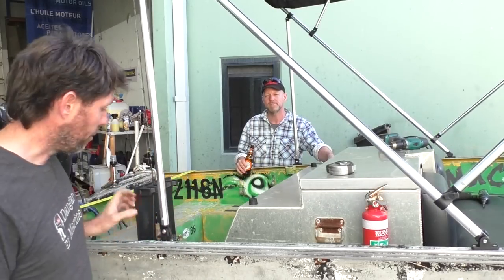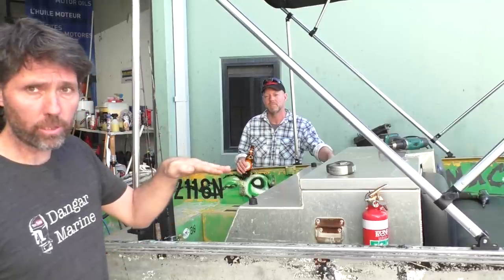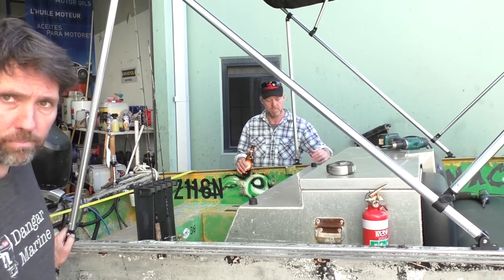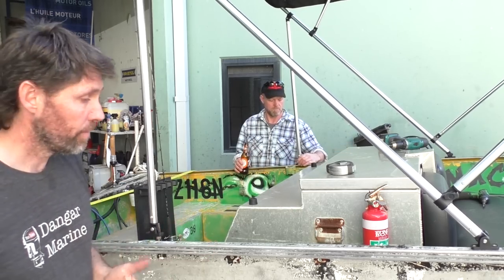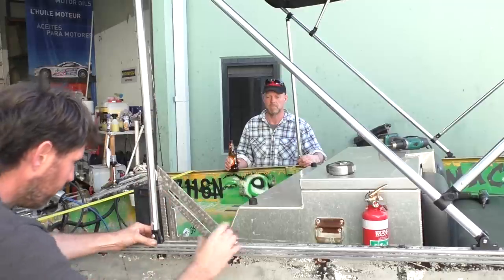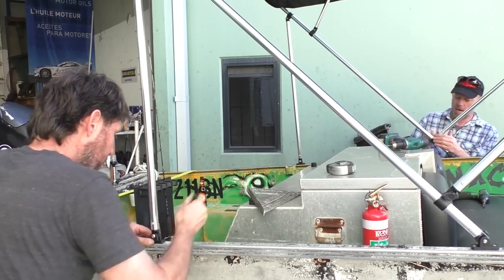Having it dead straight down gives us the most forward tilt, and the point was also made that when the boat's running along the whole boat will tilt up a bit too, so I think the more the merrier. It's movable down the track - pulling it backwards a little bit will make it a bit stronger, but as long as this forms a triangle it should be good. I don't want it a little bit off vertical so I'm going to use a square just to make it square to the gunnel. We'll run with that for a while; if it needs tweaking we can do that later.